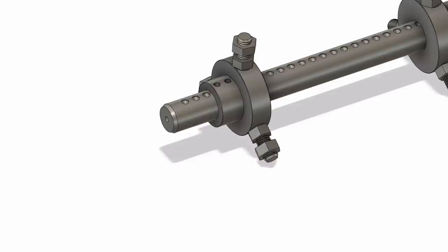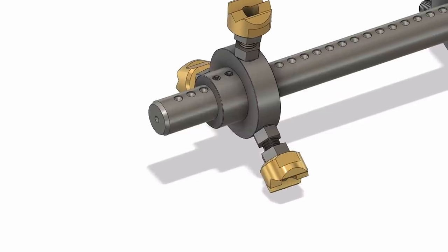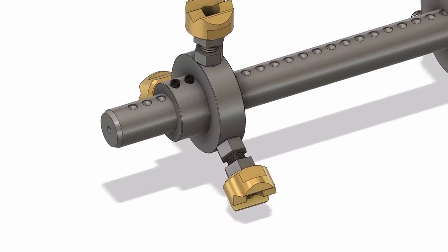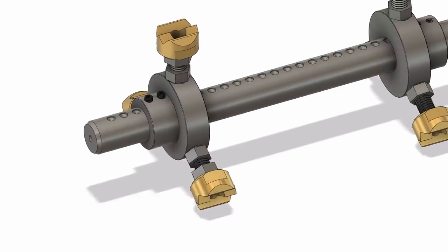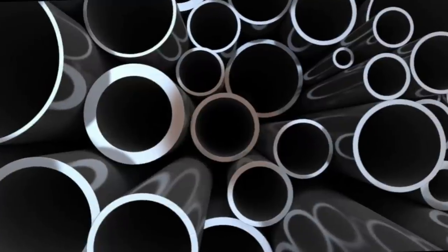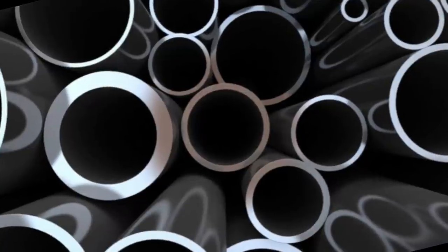For the sake of bling and shiny, I used a bar end of 30mm brass to make the jaws. They look the part and actually work really well on the aluminium tube. I allowed for about 12mm of adjustment on the studs to give a range of 24mm in diameter. That's more than enough, as there's a limited range of tubes that I need to grip. And for anything larger or smaller, I'll make custom jaws.